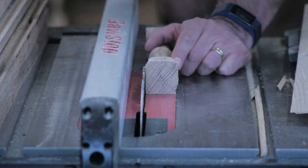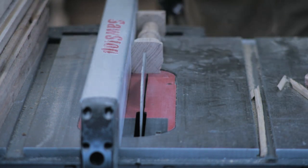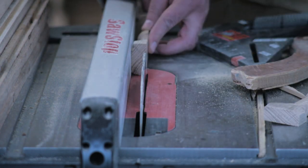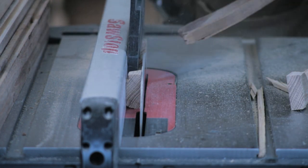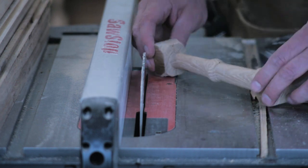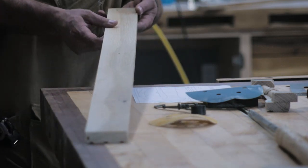This is why it was really important to leave those ends square. If you make this kind of cut on just a cylindrical shape, that's very dangerous — don't ever do that. But by keeping the ends squared, I can safely cut the center out of this and create more of that oval shape. It's a really simple way to do it.